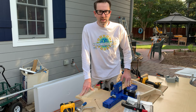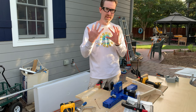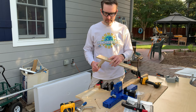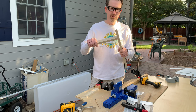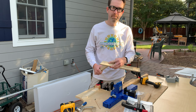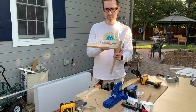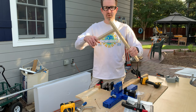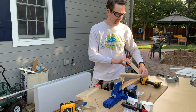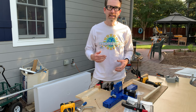Hello, I thought I would show something that I'm finding very useful right now for building my cabinets, at least the structural framing of it. Up to this point, I've been using a method where, when I put two pieces of wood together, I countersink a hole, pre-drill a hole in the back of the wood I need, and then drill directly into the wood that's perpendicular. And it's strong, but you can see it does move a little bit. A far stronger, like infinitely stronger, method is using pocket joints.